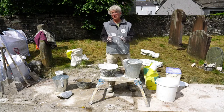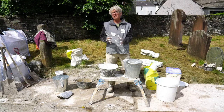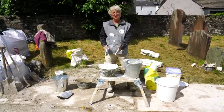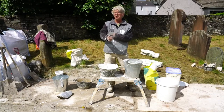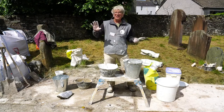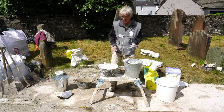Yeah. But of course it's got the suction from the core, if they're porous, and its own tendency to stiffen, and that's why I say it's a bit like gilding: there's a window of opportunity to really maximise that, which is to do it straight off the scaffold there and then, at that moment when it whooshes, if you can get it in then. It can be quite tricky, but I was doing it recently.